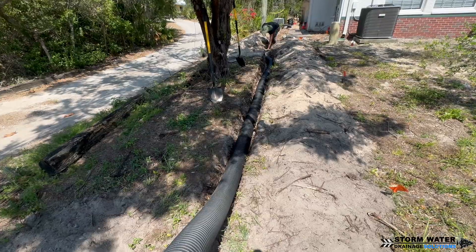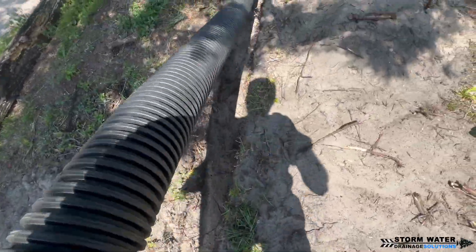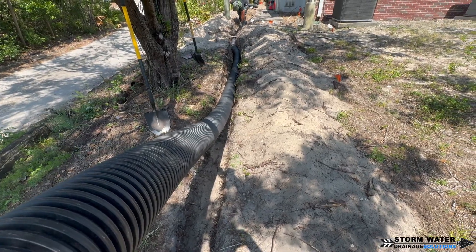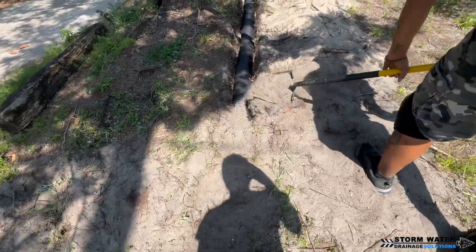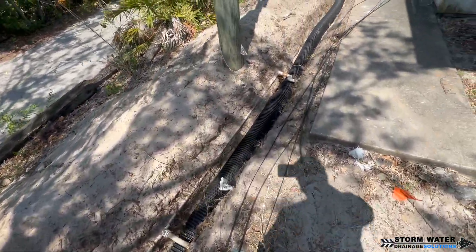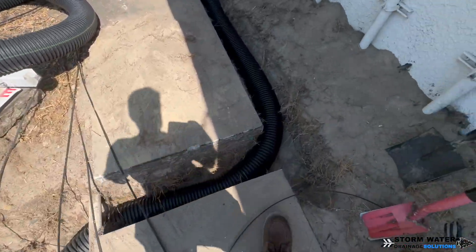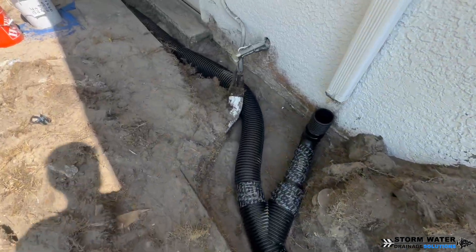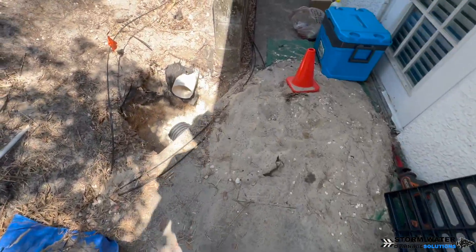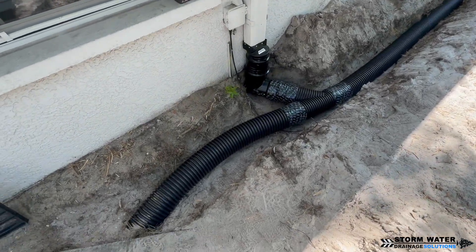When you're working with a larger pipe, such as six-inch or bigger, it's advisable to have more than one man working. It takes a lot longer to stretch the roll out and start installing it when you work alone. It's a lot easier with two or three men on larger diameter drain pipe. But we have our pipe laid, everything is pitched correctly, and we have it going under all the sprinkler, irrigation lines, and wires. Look at all of these internet lines we had to avoid — it was a nightmare back there. But this is one of the reasons why we love corrugated pipe: we can just snake this pipe through all of these obstacles. If we were installing PVC pipe, this job would have been a lot more labor-intensive and our trenches would have had to be a lot straighter.